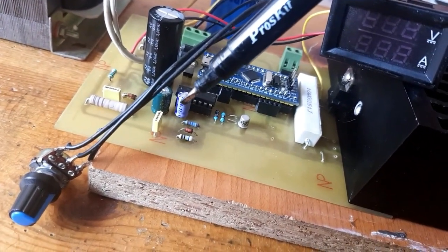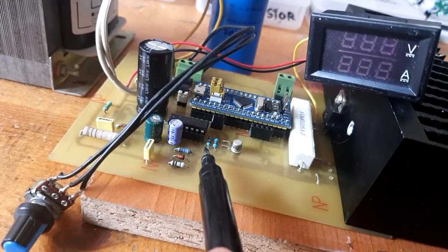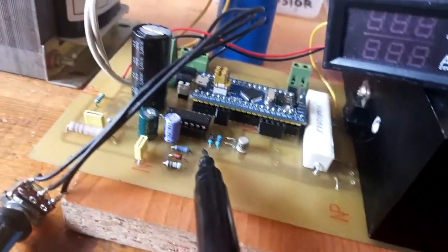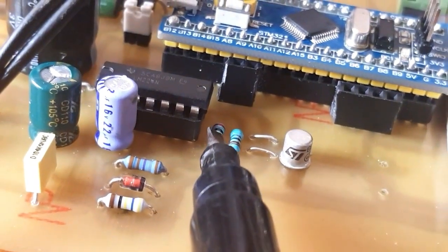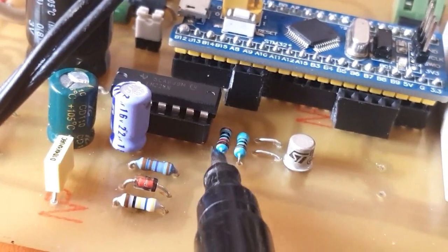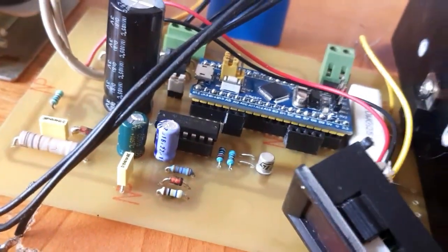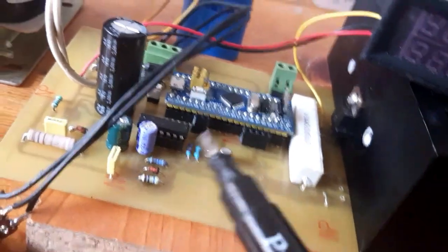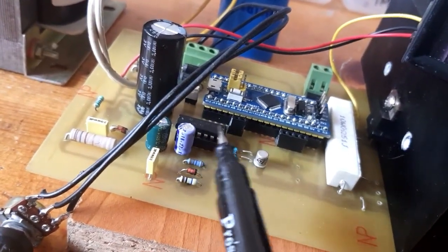Then from that gain stage it goes to a second amplifier. The amplifier has a set of two precision resistors with five color rings. I have here a 20K and here a 5K, and here another 5K. So I will have a gain of four added to one, giving a gain of five. So we will have 15 volts right here at this stage.